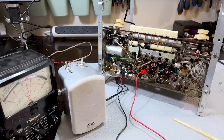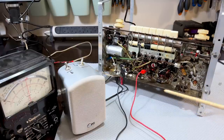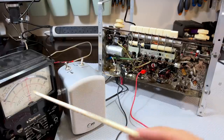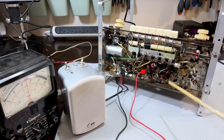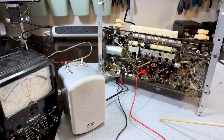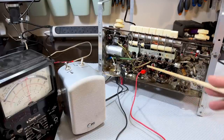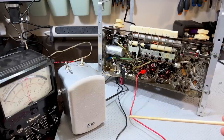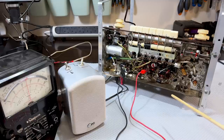We've just done it using a voltmeter — that's it. It doesn't have to be a Simpson, which was kindly offered to me by a subscriber who visited Madeira. It works fantastically. It can be any voltmeter, preferably a moving coil so that you can see the meter move, but not necessary. The point is we've done the IF alignment of the FM. If you couldn't hear a tone at all you'd probably need fancier equipment — you could do a sweep alignment, use two resistors as a balancing circuit with a microammeter. I've done that a few times on some of my videos. If you're interested, look at my playlists and choose the video on the FM alignment playlist.